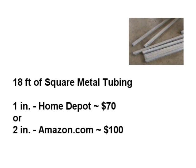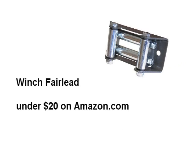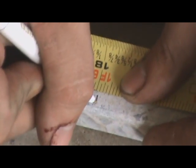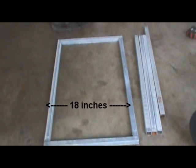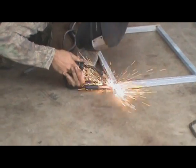The frame is probably the most work. You can get your square metal tubing at Home Depot or on the internet, or you can just order a frame from a winch website. You can get a winch fairlead on Amazon for like $10. If you're making your own frame, you'll need at least 18 feet of metal and a welder. Start by cutting two 18-inch segments for the width of the frame. The width has to be the same length as your axle, which is 18 inches. Then the length should be about 45 inches or longer, and then weld your base together.